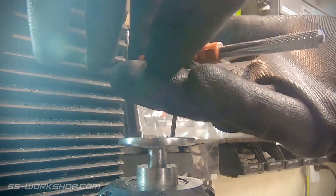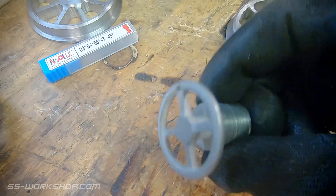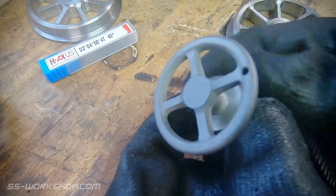I really want this part to look like a casting, as that's what it would have been on the prototype. So I'm going to use the sand blaster to remove the machining marks and soften the corners. I'm using some garnet for my blast media. As usual that worked great, and it's pretty hard to tell this isn't a casting at this point.